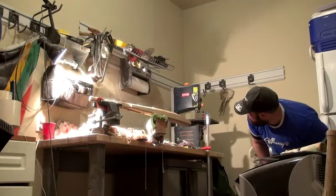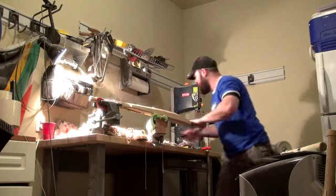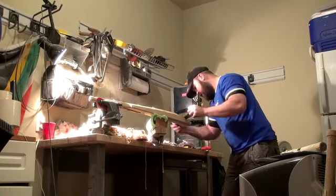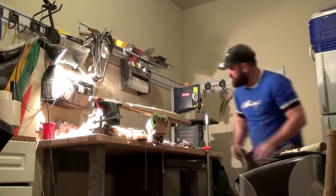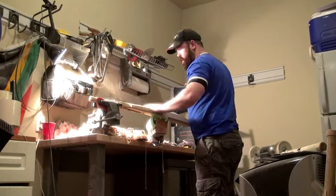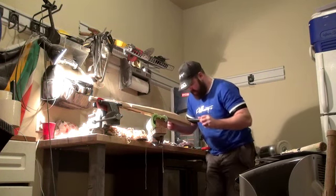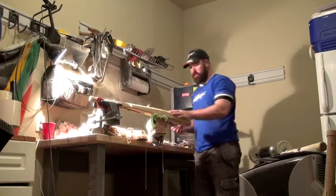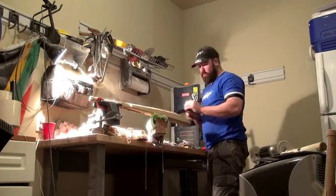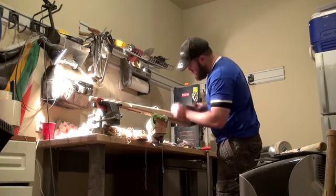Ducking in the toe now. Just want a little bit of a rise and fall, that's all. We're keeping the toe still fairly thick because we don't want a weak toe. These pieces of wood have come from the UK, already pressed and handled, so I don't really have a say in there, and I haven't been able to apply the pressure I'd want at particular areas if we're going to make slightly different shapes to what we normally produce. Each shape is done slightly differently, not by much, but like with most bats, everything's got its own characteristic, and we need to try and accommodate that.